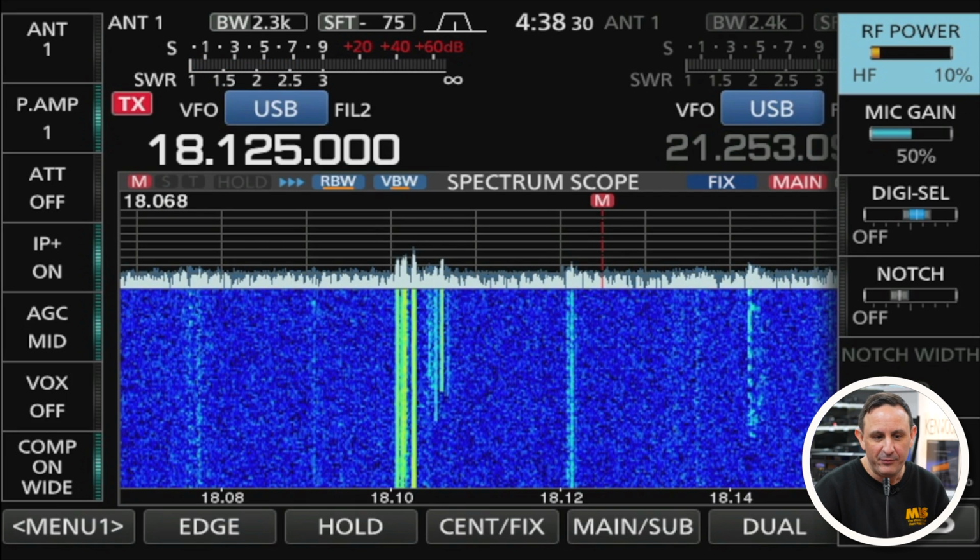Okay, yep, QSL. I've moved the beam now, so hopefully the beam's in your direction and I can give you another report on the next over. So I'm just running a test here in the store. We're currently running 1 kilowatt with an Acom 1200S linear, using an Icom 7610 to drive the linear. Just wondering if I could drop the power down and make another contact with you, QSL.